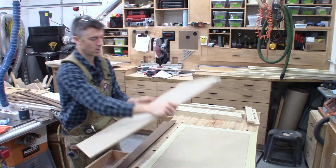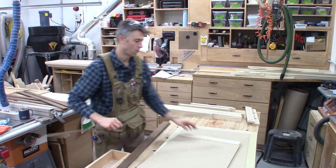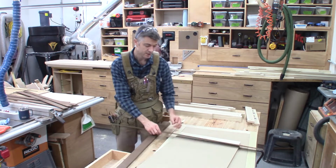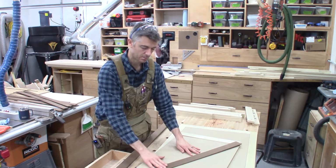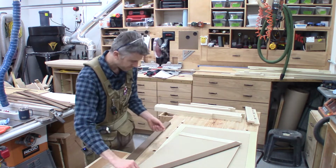And then the outside of the door has about a 1/4 inch of extra overhang. This material I bought is also roughly a 1/4 inch, and what I'm going to use here is to lay out an X design on the front of each door. These will get glued in place to the panel after the whole door is glued up.